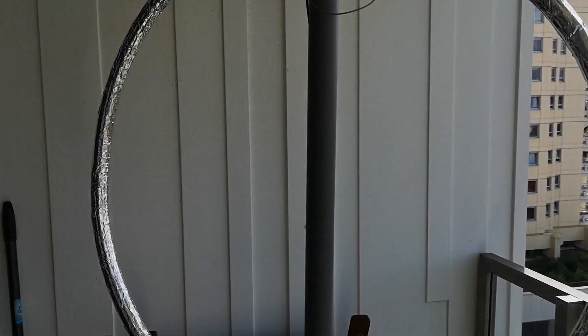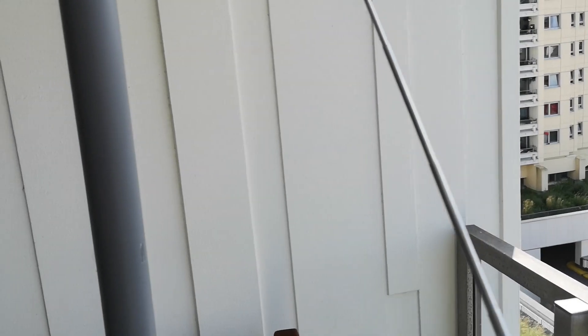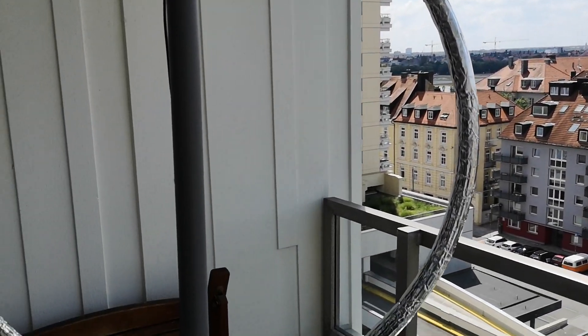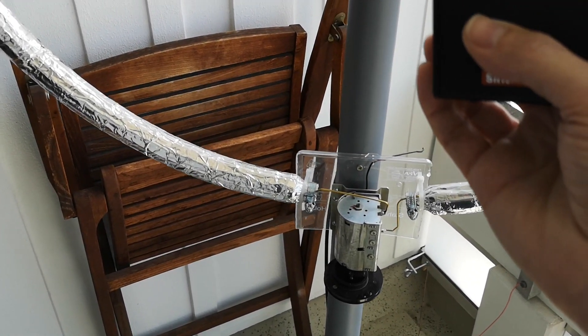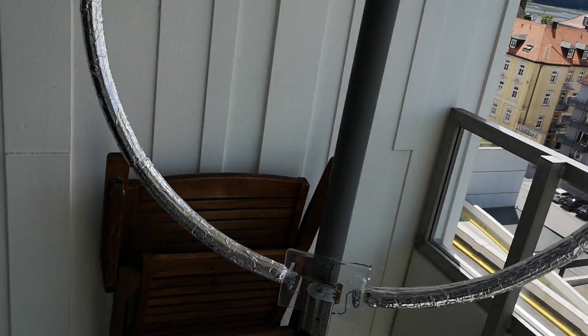What I can do is put it close to my loop antenna here. Just by placing this telescopic antenna close to the loop, the signal strength increases a lot. You can even touch it on to make contact and you get a much stronger signal. This loop is currently tuned to 14 MHz and you can see it does improve the signal strength. It's a nice easy way of tuning this loop — hold the D808 receiver next to it and adjust the tuning capacitor for maximum noise. It's quicker than minimizing SWR on a transmitter or using an antenna analyzer — a quick, cheap way of setting up a loop.